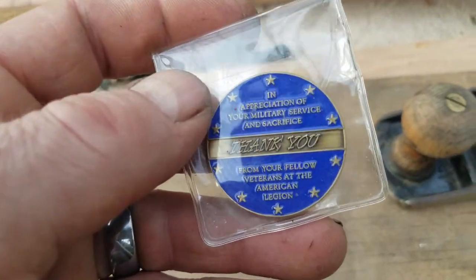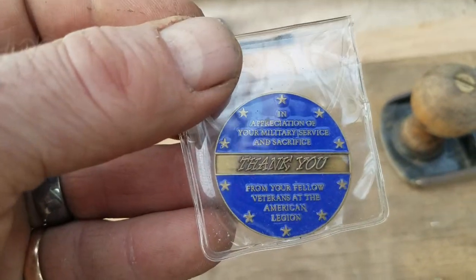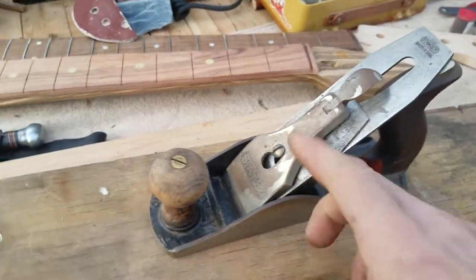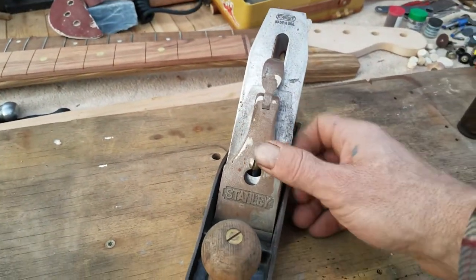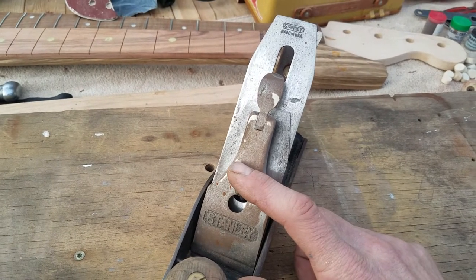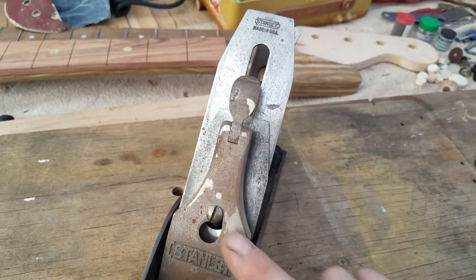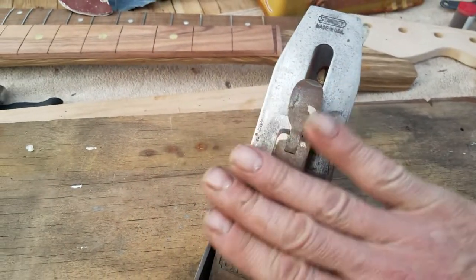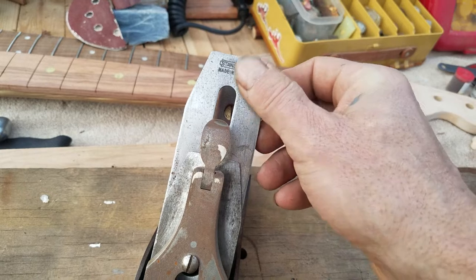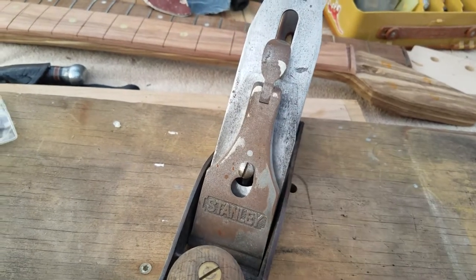Another thing soldiers get besides knives and guns is a coin. If you join the military and go fight overseas, they'll give you a thank-you coin. This right here is something I restored recently, which is not finished yet. It took on more rust because I haven't finished it. The thing is, if you're going to finish metal — you need to oil your metal to protect it. Before you do that, you want to sand it down as smooth as you can. Start with 600 grit, go to 1000, then 2000 grit sandpaper, get it really smooth, then polish it on any kind of polishing wheel. That's going to get rid of those little divots in the metal from oxidation over time. Then you oil it and it will prevent further rusting.